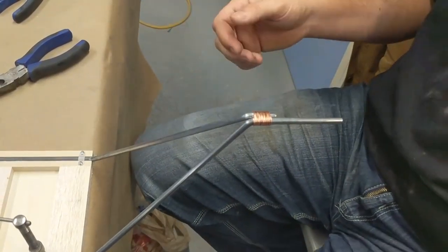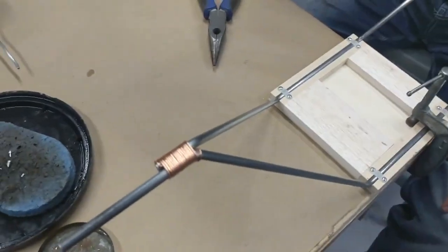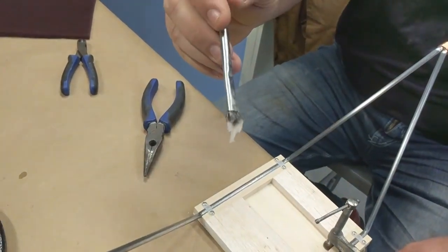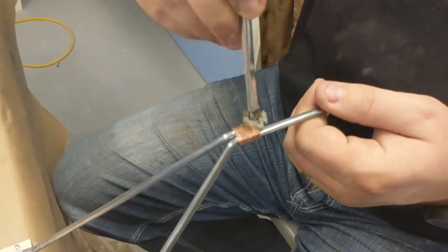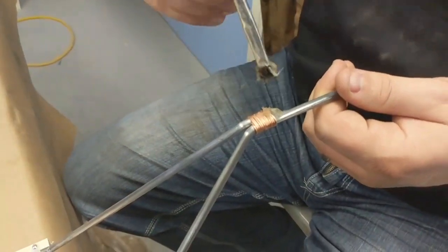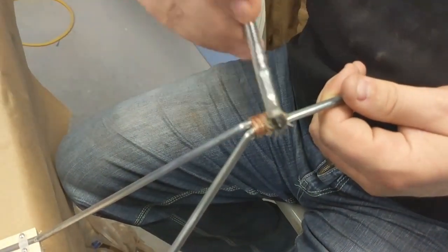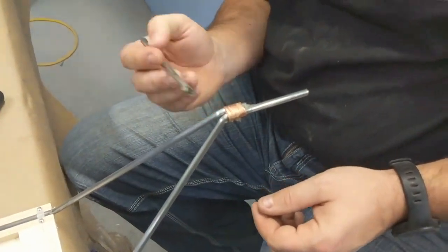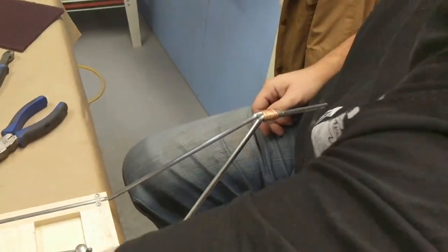You don't have to fill it crazy full. I'll take just a regular epoxy or acid brush — I like to trim the fiber small so that you can get some good stiffness on it — and I'll just paint a little bit of that flux on, making sure I squeeze it down in there and get the bottom. A big error that a lot of people make is using too much flux. Too much flux can ruin your joint just as much as not using flux. So make sure you put it on — you want it on — but you don't want it built up a half inch.